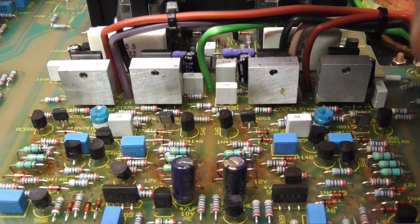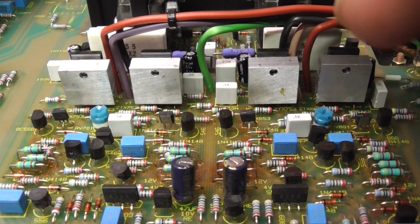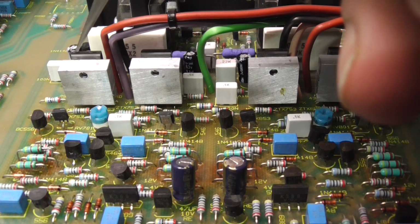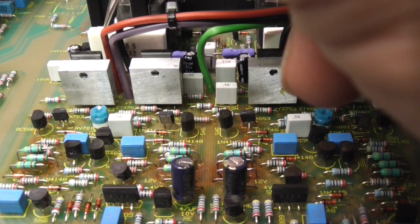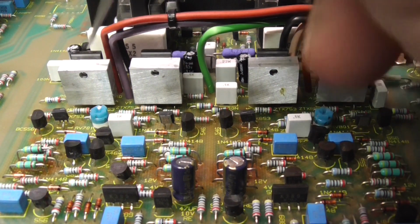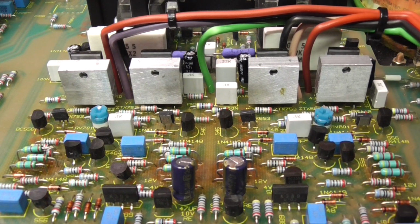It's a very capable amplifier, producing a lot of current into transient lows and things, and the power supply is very good, but the heat sinking is not adequate for this amplifier, and that's one of the reasons why these things run so bloody hot. And so these caps are surrounded by the main output stage, the emitter followers that will get warm if you're driving into a heavy load. These driver transistors are in AB mode, so they're going to be heavily biased on as well. So basically, I've changed what I think needs to be changed.